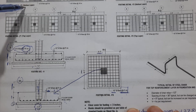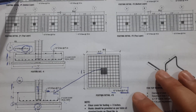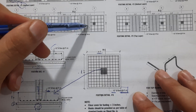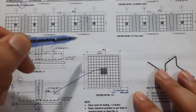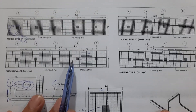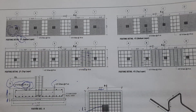For footing one, the details are on another page — the spacing and everything are the same. These columns and footings are connected by steel reinforcement which is a single mesh. The connecting lengths are five feet, five feet eight inches, and five feet respectively. We have different types of footings as you can see clearly in these details.